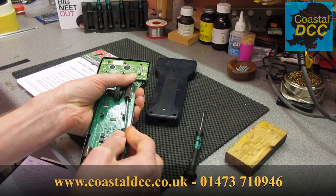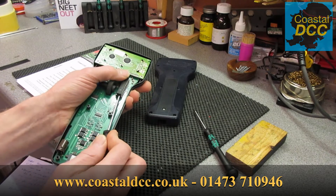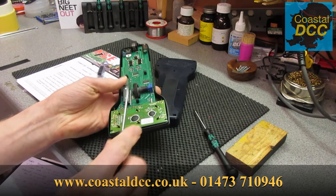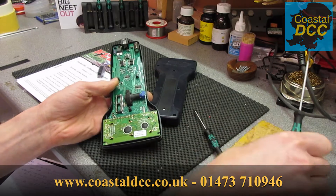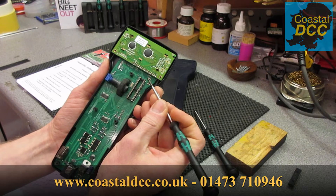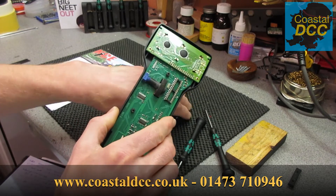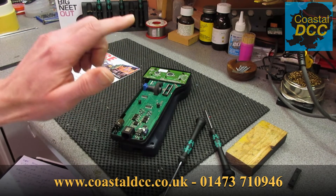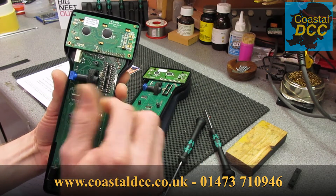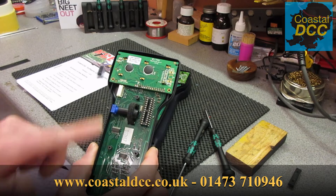You may in the future have to install it back, so it's no good if the legs are all bent. On the top of the socket there's a little indentation — that should marry up with the indentation on the EEPROM. This socket has circular pins and this one has square ones, but they're both exactly the same. The indentation at the top shows you which way around the EEPROM should go.